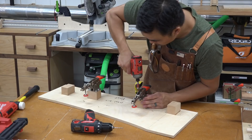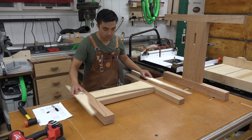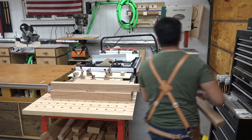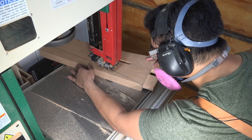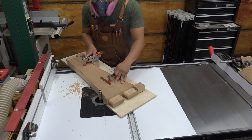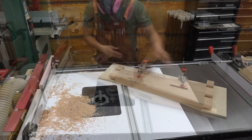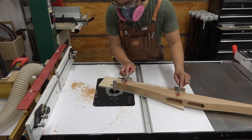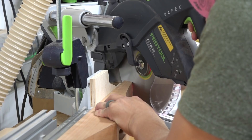I attach a couple of toggle clamps to hold the workpiece at the router table. I trace out the template onto my workpieces, rough out all pieces on the bandsaw leaving just a little bit of the line to flush trim, then cut out the top brace, foot, and leg post. Each piece gets clamped into its respective jig and flush trimmed. The pattern routing jigs only machine one half of the workpiece — I can just flip the piece, ensuring both halves are exactly the same. I'm also aiming to make downhill cuts going with the grain to prevent tearout, and avoiding routing end grain, which is why I cut the 45-degree angle on the top brace and foot at the miter saw.